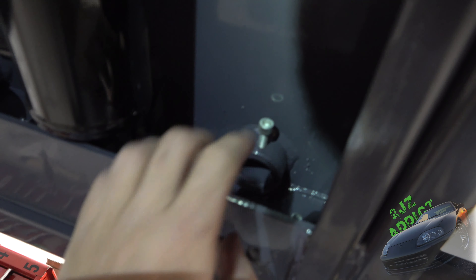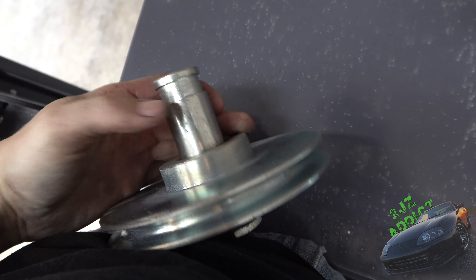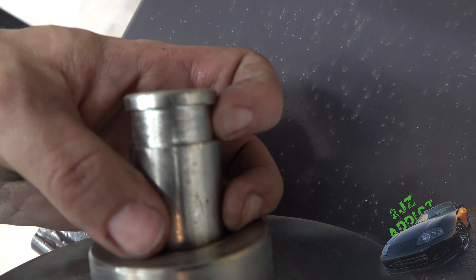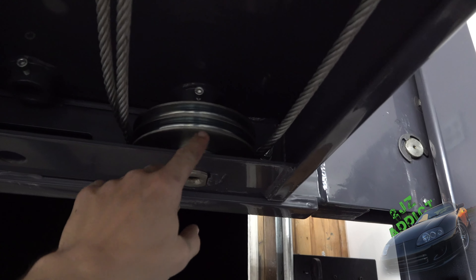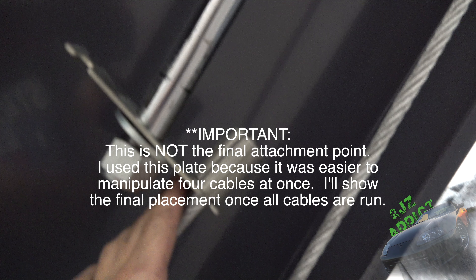Down here on the cylinder side is where the single pulley goes. You have this little pin that shoves up in there and this bolt holds it in place — once your pin, pulley, and cable are routed correctly, tighten that down and it holds the pin too. The C cable runs from the power tower all the way across, wraps around the bottom of the double pulley. There's a retaining bolt up there. That's about it for cable routing — super simple overall. I'm going to bang out the other two cables now.